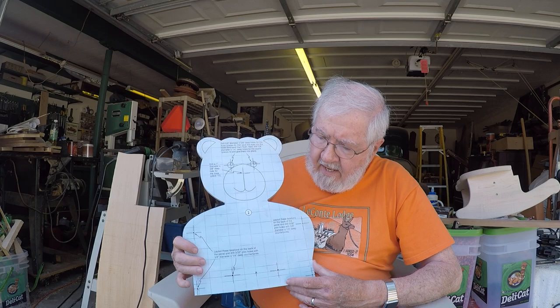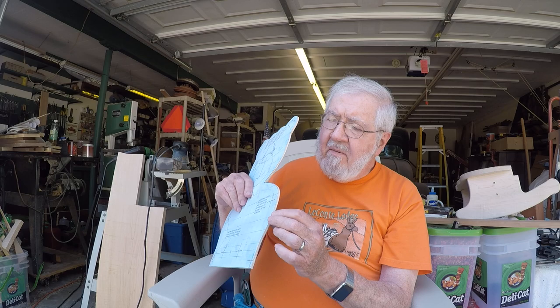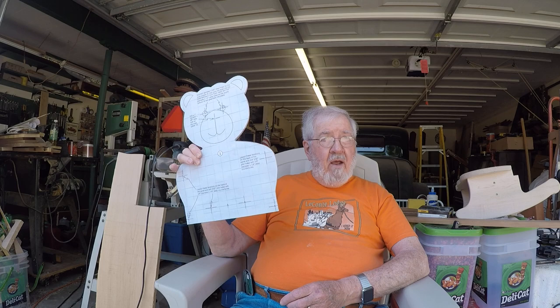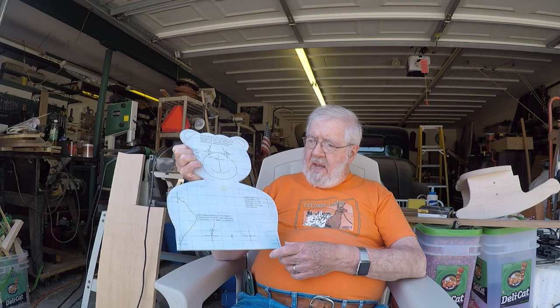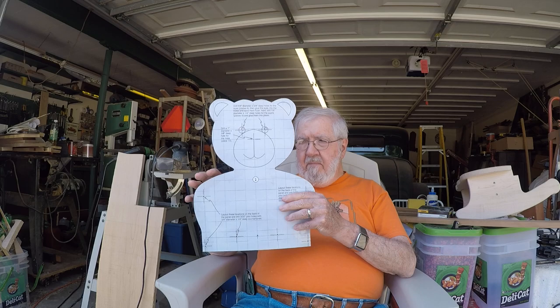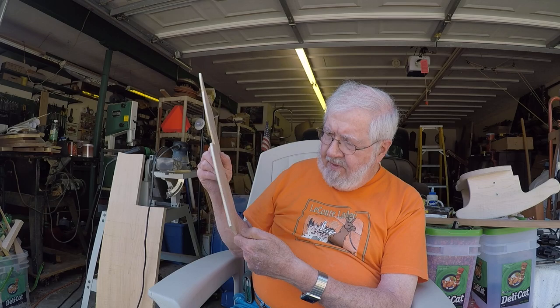What I do then is cut that blueprint out and put it on a piece of eighth-inch thin plywood available at Home Depot or Lowe's. You could also use inexpensive paneling or wall board. I do this because I intend to make more than one of these objects. Anytime I know I'm going to do more than one of a set of plans, I create these templates. I try to cut very accurately around the edge because I'm going to trace around it, and any error will be magnified when I try to assemble the object.